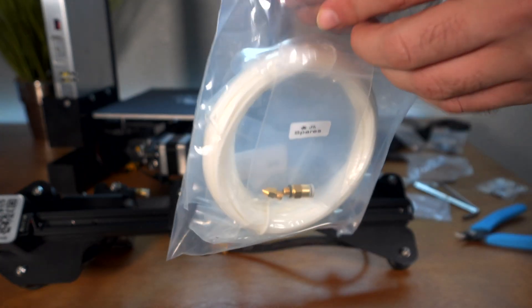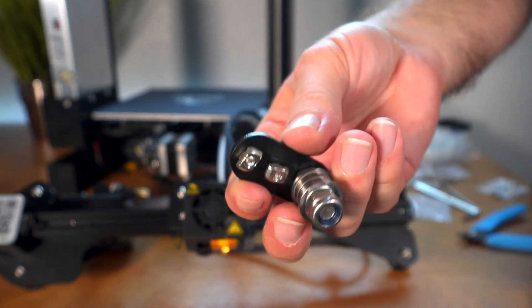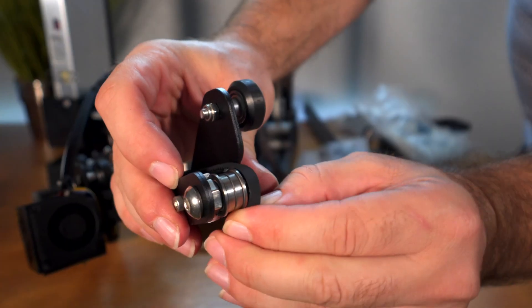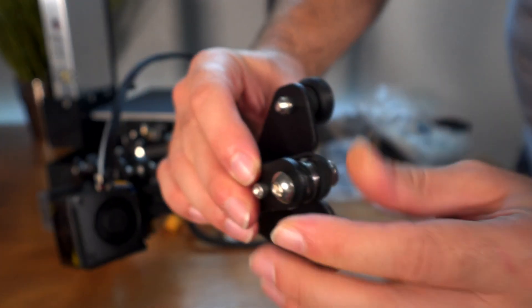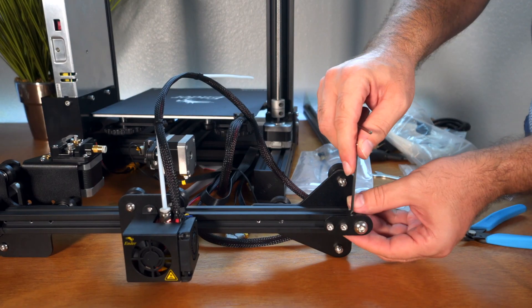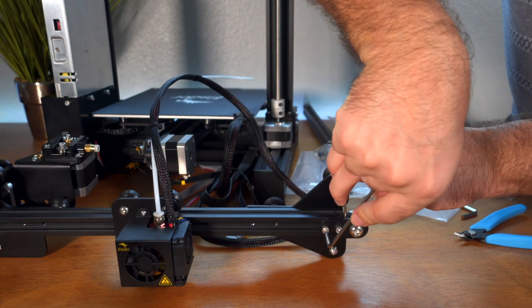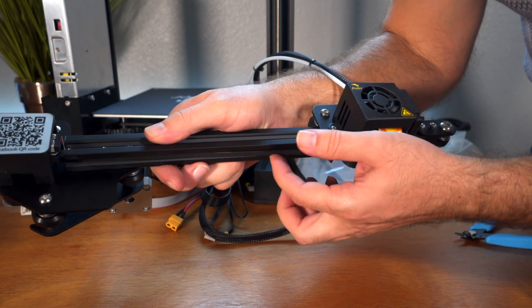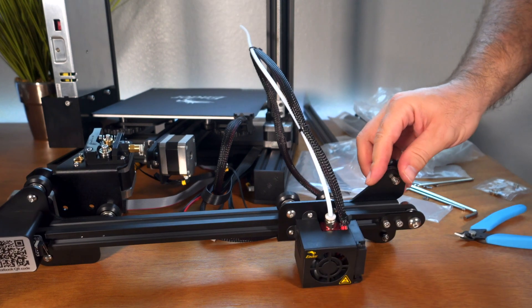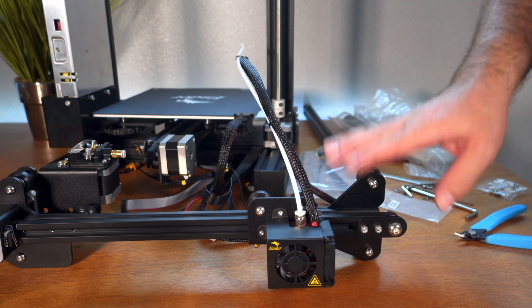The adjuster is in the filament bag. You'll be working with the little t-nuts — put those in there and the belt simply goes over this. Then tighten it up and tighten the bolts. Use a wrench to pry on it just a little to make it tight, then tighten the bolts. The belt doesn't have to be super tight, just a little bit — too tight and you'll wear the belt and components out, but you don't want it loose either. Steps seven and eight are done.